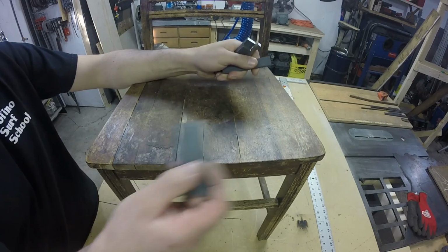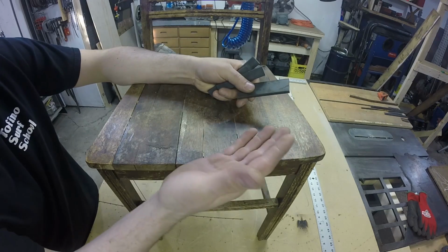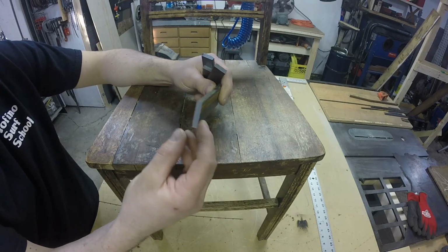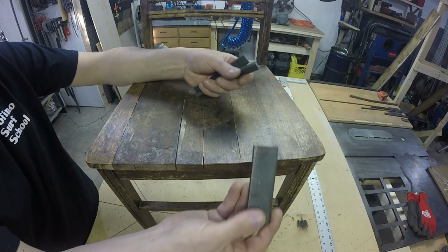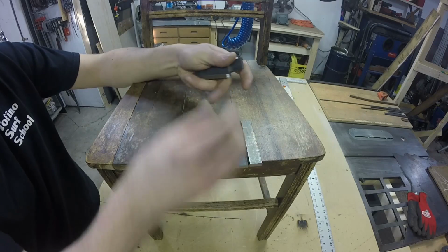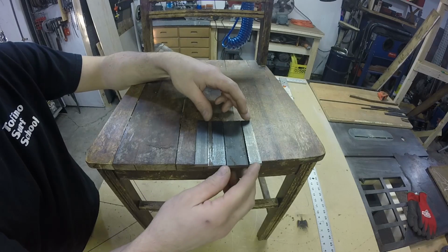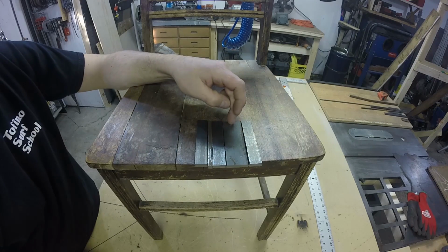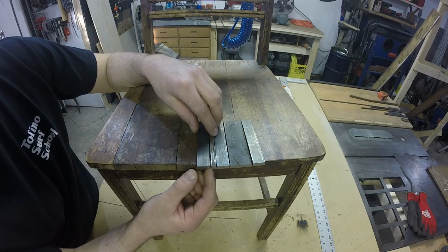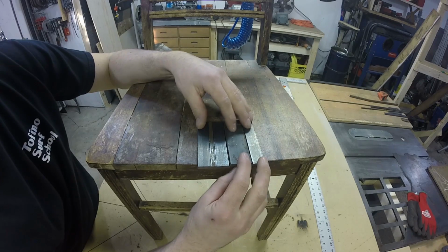So I'm going to start off with making the actual seat bottom here. Again, I'm going with quarter scale, so it's going to be pretty easy. All I'm doing is measuring everything, dividing by a quarter. This is near an inch, a little less, so I got 3/16 steel bars here that I've cut. I just cut some chunks of it out of random sizes, to kind of give it that planked look. Also going to probably do some cuts in here, so that it looks like there might be a crack in there. And so start by welding this together from the bottom, and I'm going to try and weld it so it's not perfectly flat.